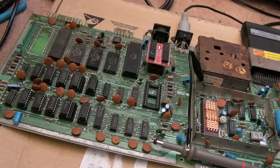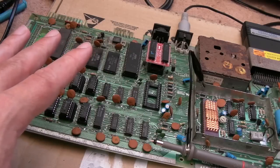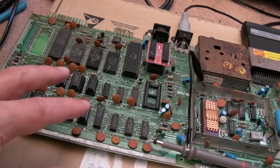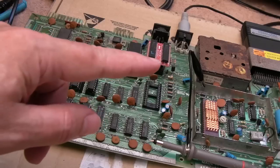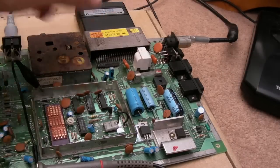Now, I've spent about an hour trying to understand some really crazy behaviour. The screens keep going black, you know, so you'd have the flash, flash, flash, there's a little bit black. And you're like, why has this only stopped? So you power cycle it, just black, nothing. And then I measured the 5 volts, nothing at all. I could smell something warming up. I was like, is it the power supply? It turns out it's the power saver. Yeah, it's cold now.